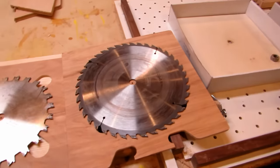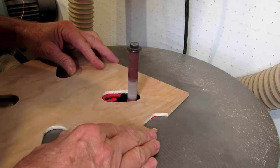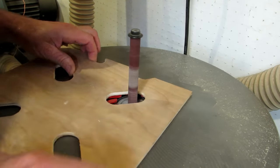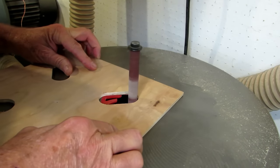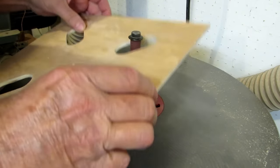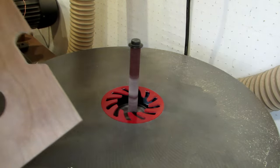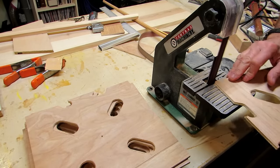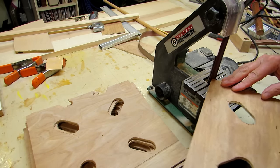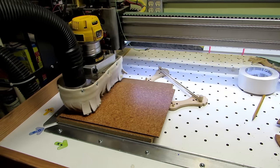There's some real fine splintering — that's kind of what they look like. I took them over to my oscillating spindle sander and used that to get the fuzz off the inside of the cutouts. With the router you have to make multiple passes at different depths and you get some fuzz where they meet, so the easiest way was to use some fine sandpaper on that sander. Then I used a Harbor Freight belt sander to get a little bit of radius and break all the corners on the panels.